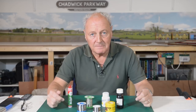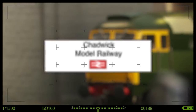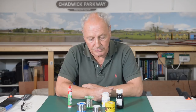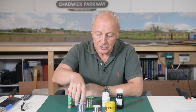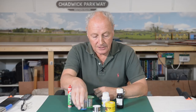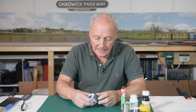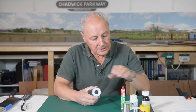Soldering — what's best for the railway modeler? About six months ago I made a couple of videos regarding soldering, and about three months ago I tried a different solder. I've now switched to a 60-40 tin-lead mix. My use of the other solders and fluxes has somewhat diminished because this stuff just seems to flow so much better, and when I use it on track or circuit boards it does the job much better than those previous items.